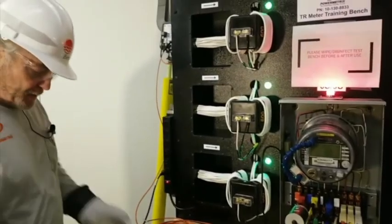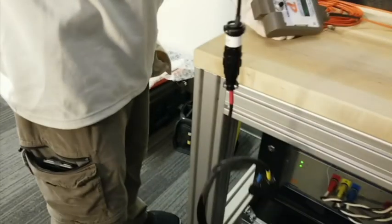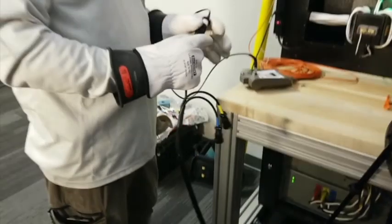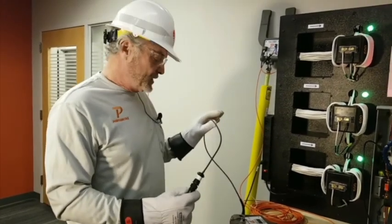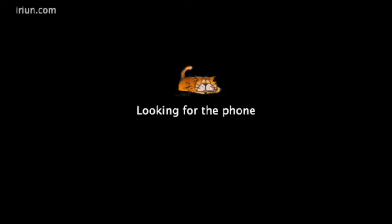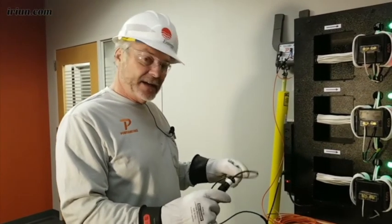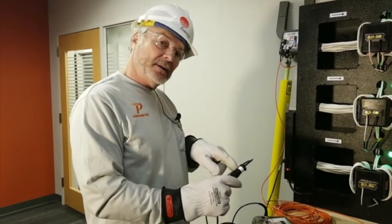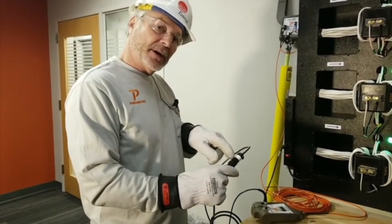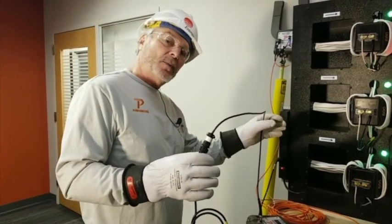Okay, we have the base unit here, and the base unit is connected to my probe adapter cable with my signal cable. That's what we call the signal cable right here. And if you've heard signal cable, you might have heard it because when you have a new piece of test equipment but an old high volt probe, can it work? The answer is that yes, it will if you have one of these signal cables. See, here's where we got the chip in there to calibrate. So as long as we got this chip in here and can calibrate it, then we can calibrate it even with an older high volt probe on a new piece of test equipment.